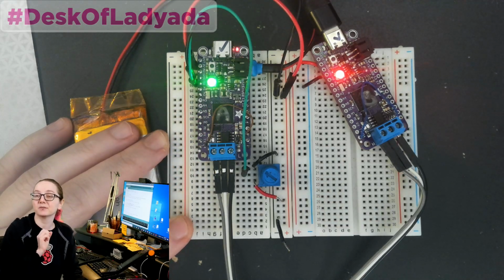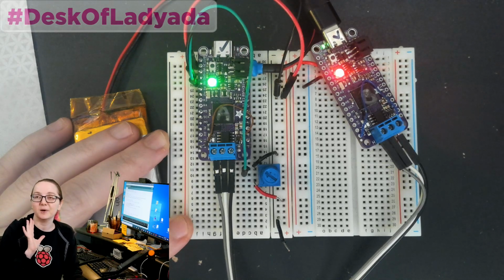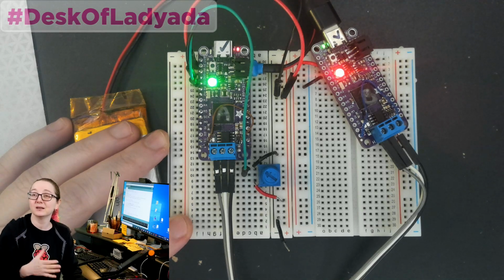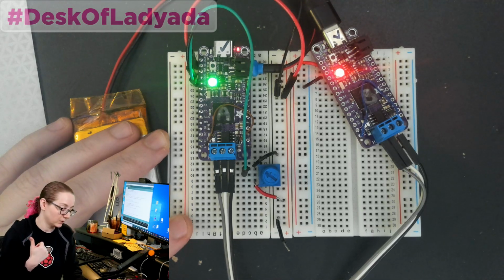I use a switch cap converter. I love switch cap converters. They're very small. They're low cost. They work quite well. You can feed them. They're not as efficient as an inductor-based boost converter, but if you don't need a ton of current, like 100 milliamps or less, they work great.